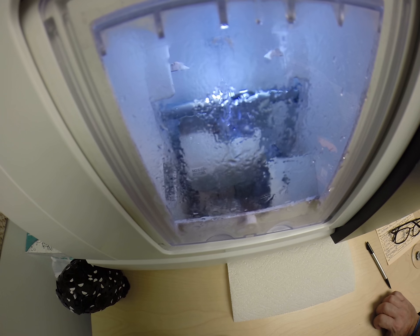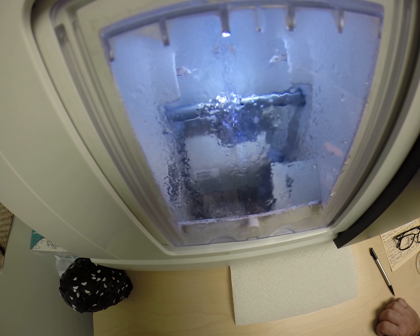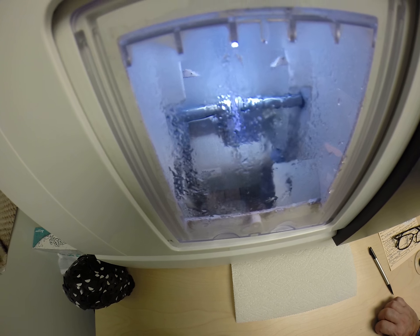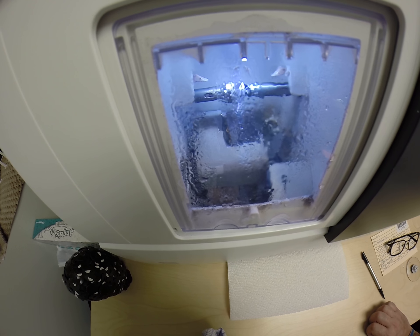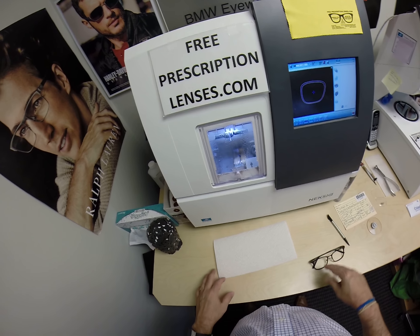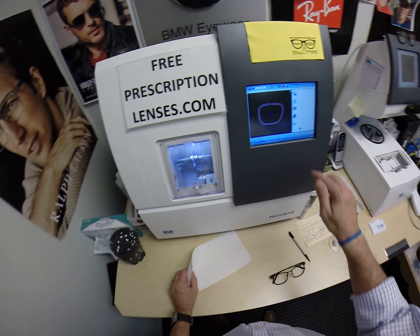Water has begun spraying, which tells me it's in the last 20 seconds where the lever has come out with a spinning disc on it — that's what's applying a safety bevel to the back surface of the lens, essentially just to smooth out the lens in case you have any rough edges left over from the cutting cycle. No portion of this lens will protrude from your frame, but the reason why I put a safety bevel on the back surface of the lens, I will demonstrate right now.